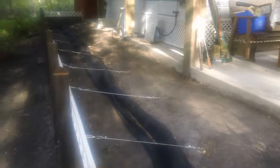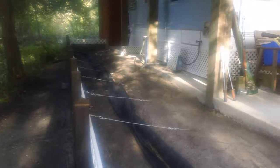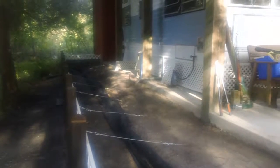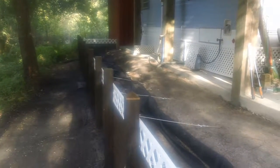I wanted to show you something though. And there are all of the duckbill ground anchors. They came out just beautifully. I was able to really tweak all of the posts so that they lined up really quite nicely. As you can see, I don't think there's an 1/8 of an inch difference between plumb from any of them. In fact, I pulled them in just a little bit so that the bubble hit the right edge, just in case there's any softening of it.